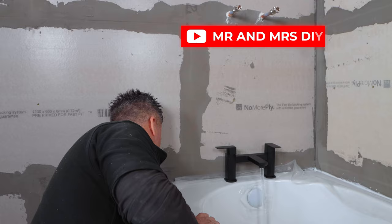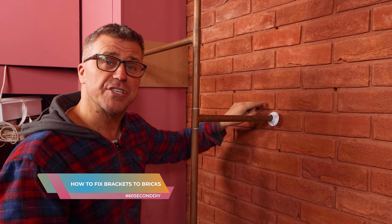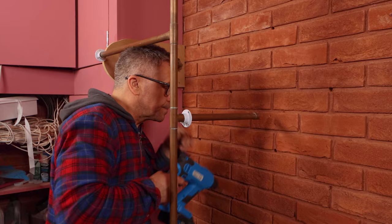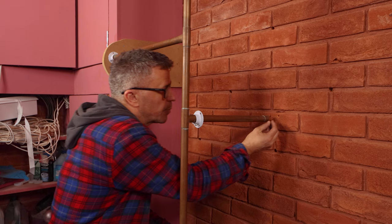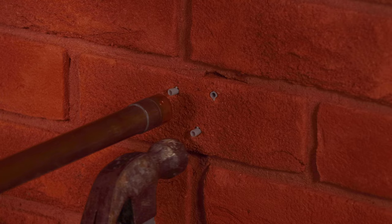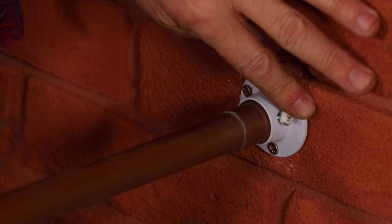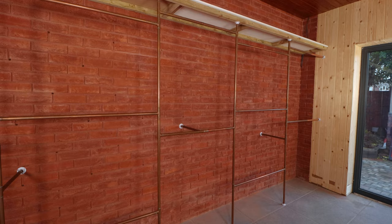In this video I'm going to show you how to fix a bracket to masonry brickwork. Place the bracket to the wall where you require fixing and mark with a pencil. Get yourself a masonry drill bit with an SDS drill or a hammer action drill and drill the holes deep enough ready for your plugs. I'm using a plastic raw plug — push this in so it's flush with the brick, making sure the diameter of the plug is the same size as the drill bit you've used. Slide the bracket into position lining the holes up. Start the screws off by hand first, then get your cordless screwdriver and finish them off. I've got a couple more brackets to do to complete my clothes rail made out of copper pipe. That's how easy it is to drill, plug and screw brackets to a masonry wall. Don't forget to like and subscribe and leave us a comment.